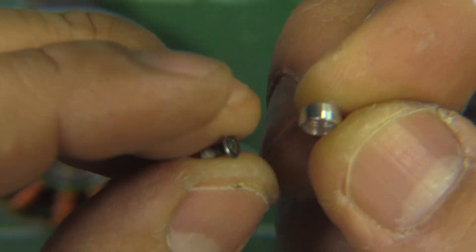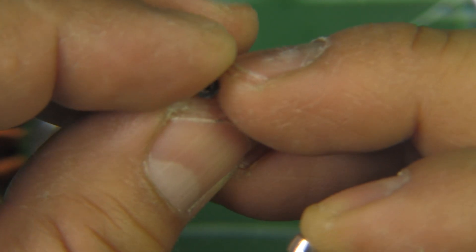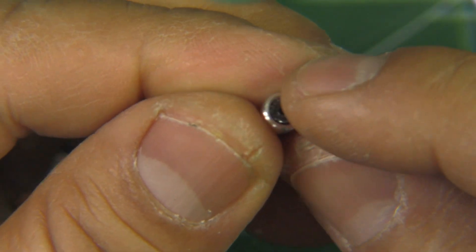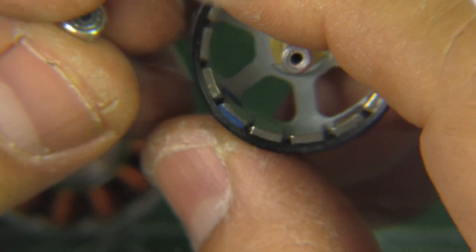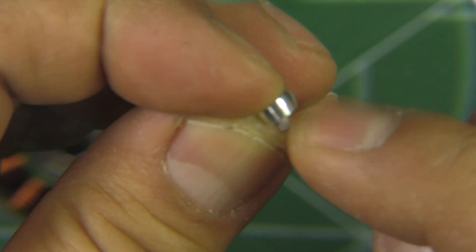That's the retaining screw with the aluminum washer. They're using this countersunk type of screw — not the best choice, really. I'd like to see either a button head or a socket head screw, as those are much easier to remove because you have a deeper socket for the Allen key, which helps prevent damage to the screw. So that's just a minor criticism. You just have to be careful when you remove it — use a really good Allen key and heat up the screw with a soldering iron. And as I mentioned, they are using that white Loctite, which is one of the hardest to remove — it sets in really well.